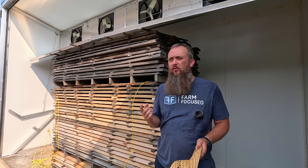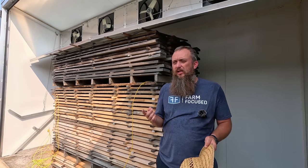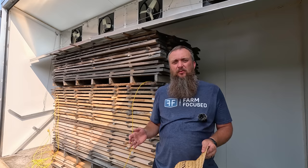If you are gonna saw oak in the summertime and air dry it before you put it into a kiln, I would put it in an area with limited airflow, completely out of sunlight, and almost create a situation where you don't want the oak to even dry, like you wanna keep it from drying. If you think of it that way, it's going to dry really slow, and it takes away a lot of those errors that can occur with oak, such as the case harden. That's a real problem in oak if you dry it too fast.